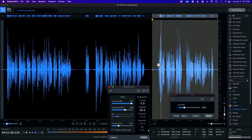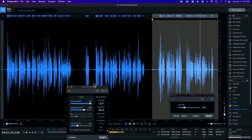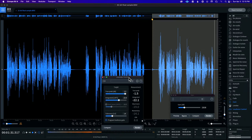Okay, and here is with 10 dB of gain. Again, still the same microphone, the Earthworks SV33. And let's see what happens now. Right now we're peaking just over minus 46 dB on the dB full scale meter on the Zoom F8n Pro. And again, still recording with the Earthworks SV33. See what it sounds like.